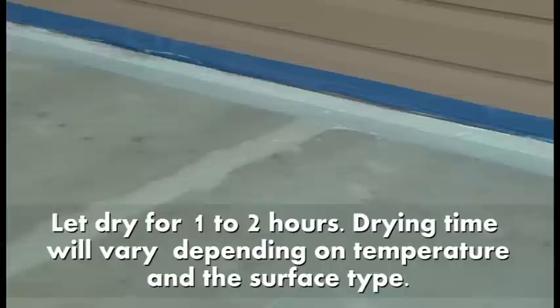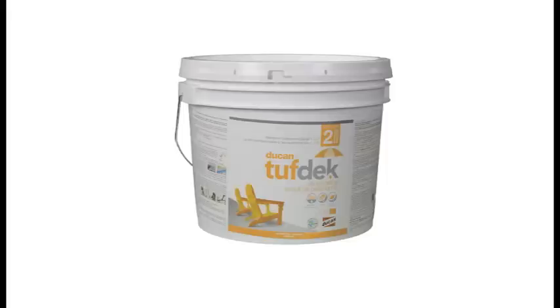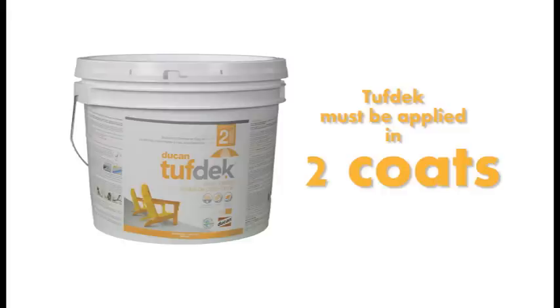Step 2 texture coat is a dense coating that is meant to be applied at a rate that is considerably thicker than regular paint. The texture coat is to be applied in 2 separate applications. Please review the spread rates in our Tufdek brochure. Check the spread rate after completing 1 sheet of plywood to be sure you're applying enough product.